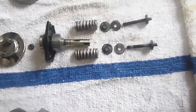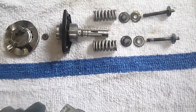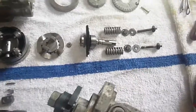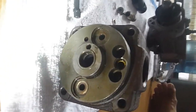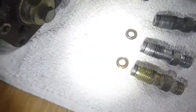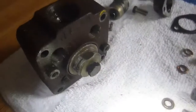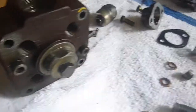So then we move over to the rest of the pump. The springs and the main high-pressure plunger — this is what sets your timing. That main high-pressure plunger actually goes into this hole — that's the socket plunger on the head. And that head, as it rotates, produces pressure to each of the four cylinders. If you have six, then it'll be six; if you have three, then three. It produces pressure to each of the sockets on the rear of the head.